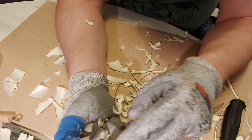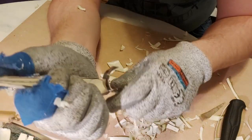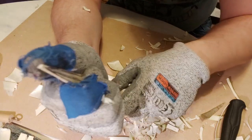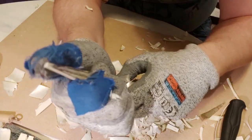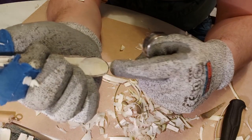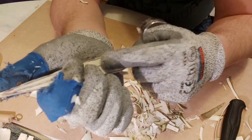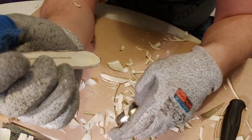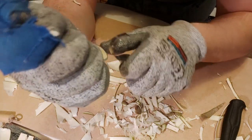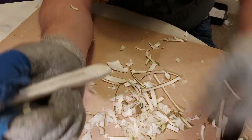You'll get to the point where it's just rocking back and forth, and it glides through like butter. Keep going until you're deep enough and you've got a smooth enough bowl. Look at the spoons in your cutlery drawers — how are they formed? Most of the time the deepest part is right in the middle, so make sure that's where it is and taper it out to the lip so you can get that little sip. It's going to go shallow near the end because being flat it'll pull right back onto your hands if you're using it as an eating spoon.